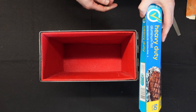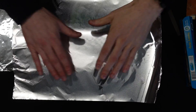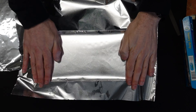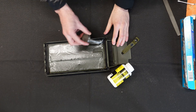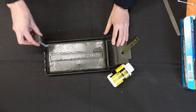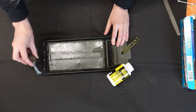Now that we have our sanding complete, we want to add several layers of aluminum foil to the top sanded edge so we can create a metal-to-metal seal with no seams and no gaps. Make sure this is nice and smooth with no burrs before we add two to five layers of heavy duty aluminum foil. If you have room and can effectively close the lid, you can add up to five layers, but you want to use at least two. Now we're going to lube the rubber gasket with silicone, which will be gentler on the foil when we close the lid and will also keep the rubber seal moisturized so it doesn't dry out and crack.